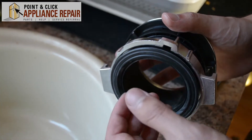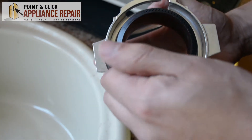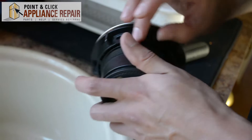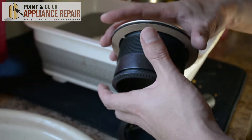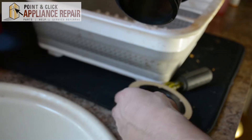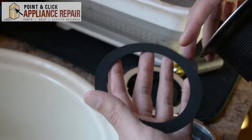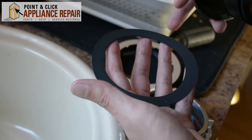Now for the flange, we're going to have to take this apart. We've got this bottom piece here — this gasket is going to come out first, and then this metal piece comes off. Now we're going to unscrew the plastic piece here and set that off to the side. Now we've got a couple of gaskets. This gasket is going to come up underneath. And then this rubber gasket — if you look at the instructions, it says for stainless steel sinks. We don't have a stainless steel sink here, so that's why we're using the plumber's putty. But if you do have a stainless steel sink, instead of using the plumber's putty, you would use this rubber gasket as it says in the instructions.